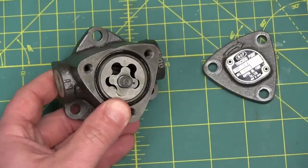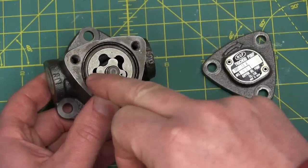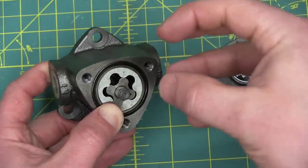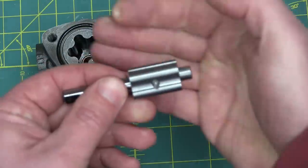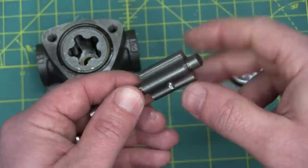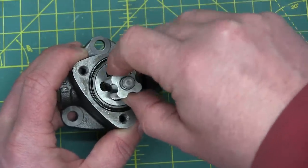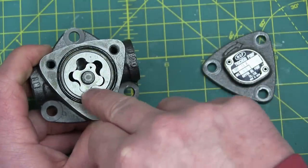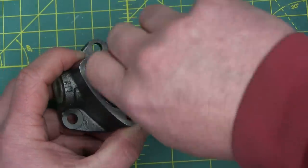What's the failure mode of these things? One is just cavitation wear. If you throttle the inlet — if there's some restriction on the inlet — the pressure drops so low that the fluid cavitates: it actually boils. It forms little vapor bubbles, and when those vapor bubbles collapse there's a supersonic shock wave that takes out a chunk of material. You'll end up seeing dull, bubbly-looking sections on the rotor. That changes the internal clearance of the pump, and eventually it just won't pump because it doesn't seal. More than likely prior to that you'll get damage from schmoo being in there — metal chips, gold nuggets, ball bearings and so forth. It wouldn't take much of a metal chip to get in there and seize that right up.